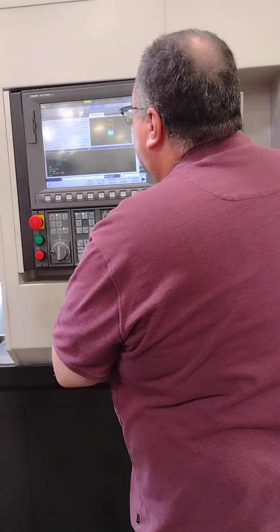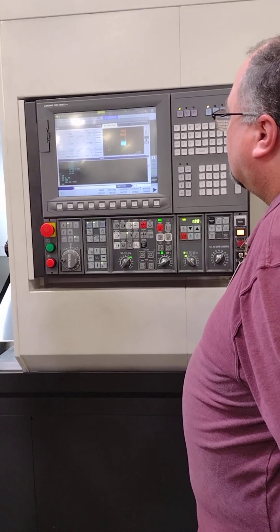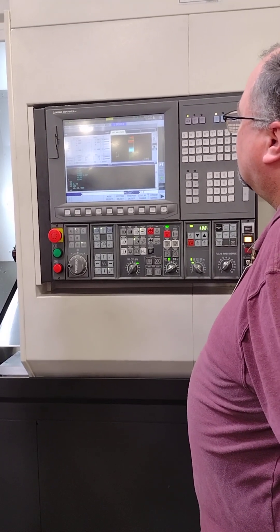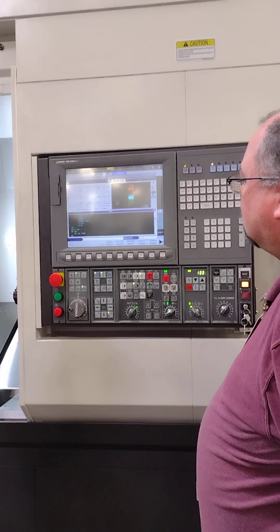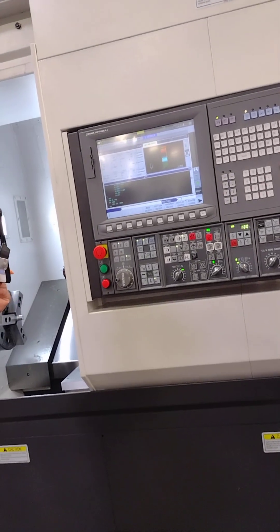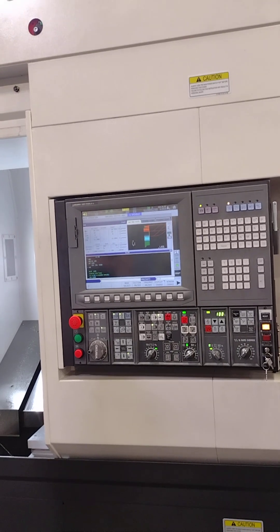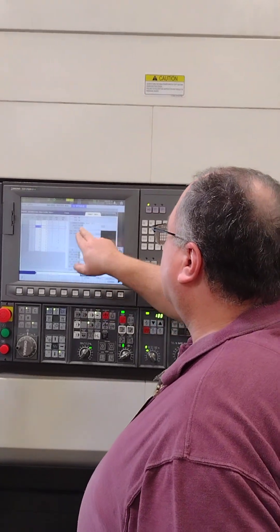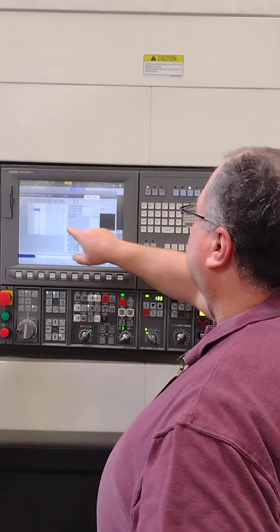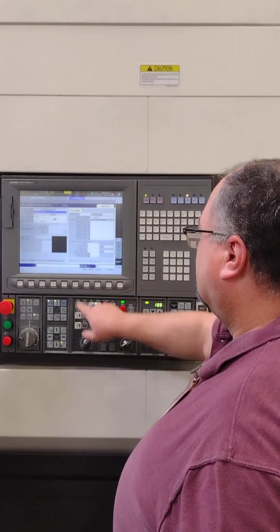Something is not right. What tool is this? Tool 303. We'll have to look at tool 303. That's a boring bar — it punched a hole and then it's just boring. I don't see a tool. It could be that the program is written to start at 2.3 on the board and you have a 2-inch drill. Tool 3 is written for that size. What is the size of the drill? See, I don't have a tool there — that's why.